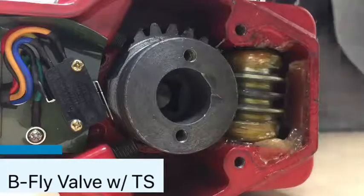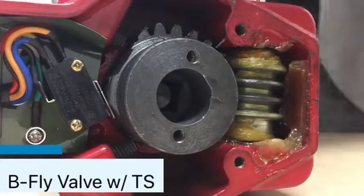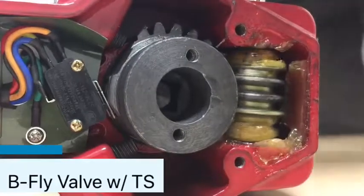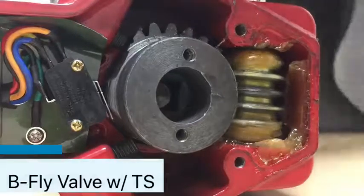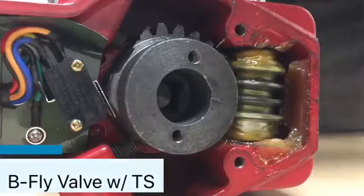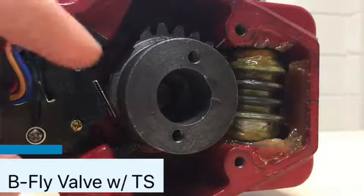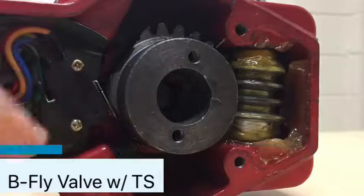So let's try it. I'm going to go ahead and turn it. You hear that? That was one full turn right there — so it did it in less than two turns. What it does is it's relieving that pressure on this lever and releasing those micro switches, and that's what actually sends the signal.